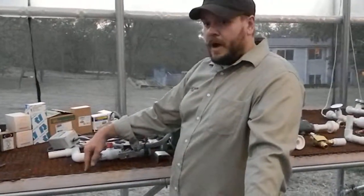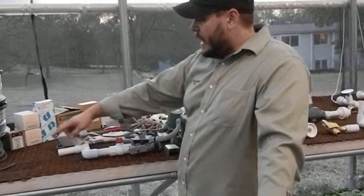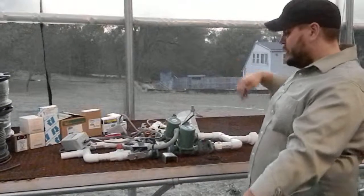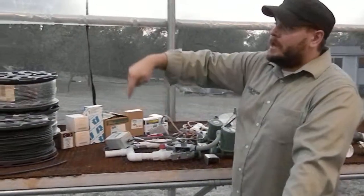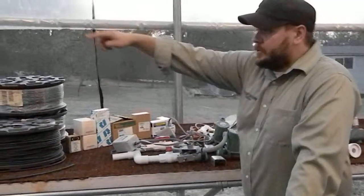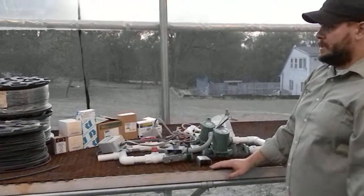Inside of this, we've used a router, and we've routed out different lines inside of this system. The system will be coming in from the end behind me, so what happens is each one of these lines comes out, gets to the far end, loops around and comes back. So there's a hot, and there's a return even within the actual loops inside the system.